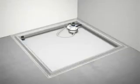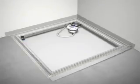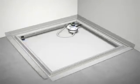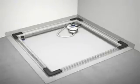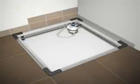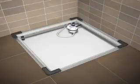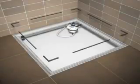Insert the pre-adjusted ESR and fix the siphon trap in the designated position with the fixing arm. Connect the drain-off connection and accurately align the installation system frame. Then secure the frame with the wall anchors. Now apply the non-woven butyl tape along the frame and stick it to the walls and the screed floor.